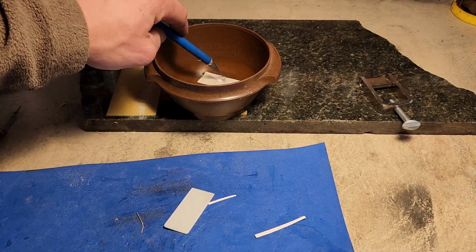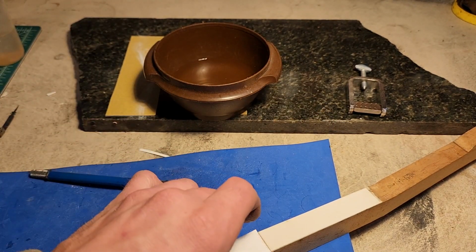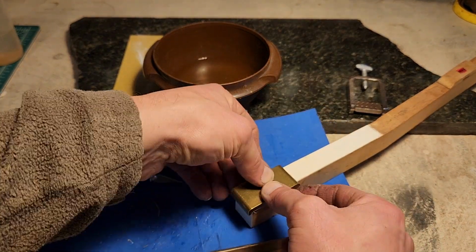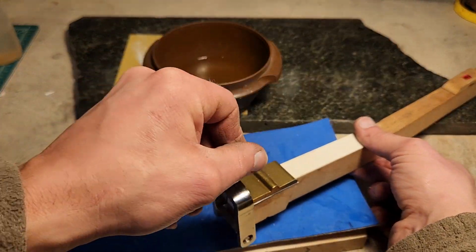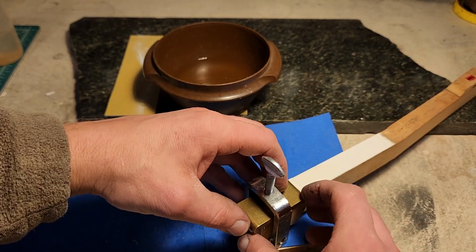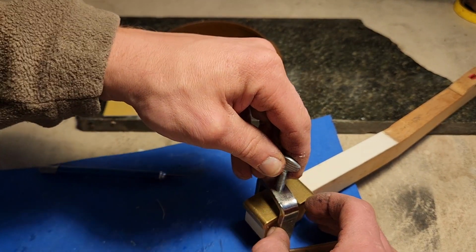and do it right. I soak them in water for 30 seconds, then place them on the key stick, and I use my heated clamping pad, which is heating next to me on an upside down iron, and without getting burnt, get it exactly where it needs to be while making sure the seam between the head and the tail on the key is nice and tight, just like they did it at the factory.